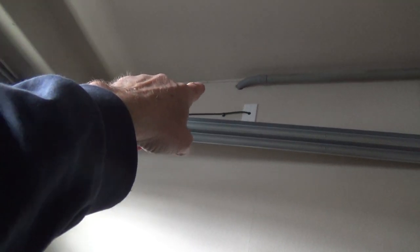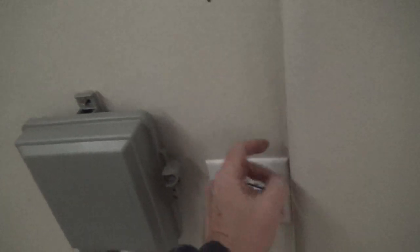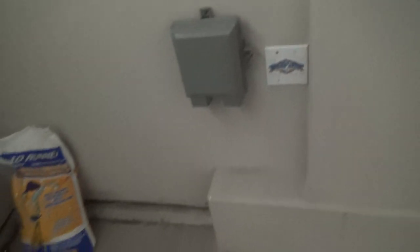I can get it up off the floor just barely, pull it up, zip it out through there, and have a nice tight 90-degree angle going right out there. It's going to be coming out of this sheetrock right here, probably right in here somewhere. Then I'm going to have to go across, go up, go across, go down through my cut-in box that I already have up there, and then come back down. Or I could go across, up, over, across, and then cut a hole and sneak it down behind this blank plate. Or I could pull a blank plate off, cut just a little groove in the sheetrock, and have it kind of push down in the groove behind the blank plate. I've done that before and it looks pretty good. Something like that, and then get the coaxial cables for the TV.